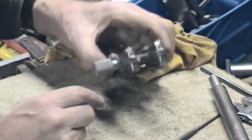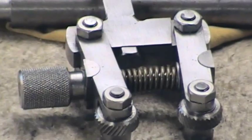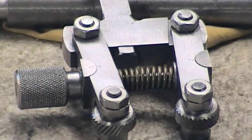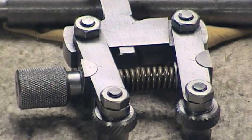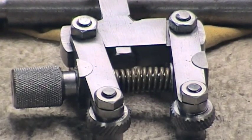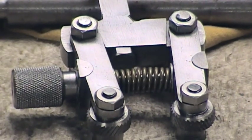Now these wheels have been used for ages. If I zoom in slightly tighter and just get a slightly more detailed look at it - there we go, we get the general idea. It works extremely well. I don't think there's any knurling approach I could find better. And if I had to work on larger material, I'd make a larger version of that. There's nothing to beat getting these two wheels almost over top and bottom centre of the workpiece. The pressure is taken very much by the tool itself, and so this has done a lot of work. Love using it.